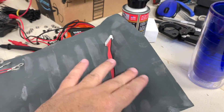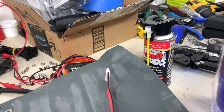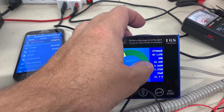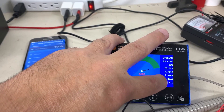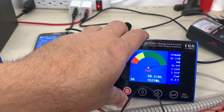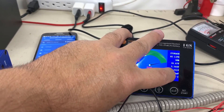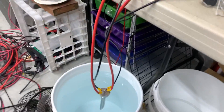The studs aren't going to move around while I'm twisting the nut on top, which is important so that you don't bottom out the stud while you're tightening it. It also allows me to use the torque wrench on top of this nut because I won't be able to hold the stud in place with an allen key while I have the socket on top. Now I have a properly torqued system, the threads are going all the way in. I basically polished the top of all the terminals to make sure there wasn't any oxidation — this is 1000 grit sandpaper — then I used some deoxidizing spray to clean them up. I assembled everything, torqued it down, and currently on the BMS you can see a maximum of 20-23 millivolt difference between the cells.